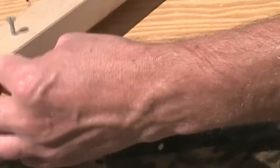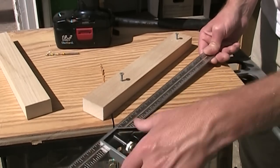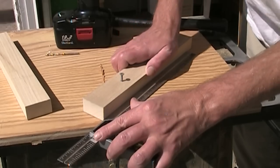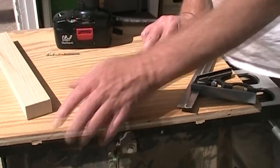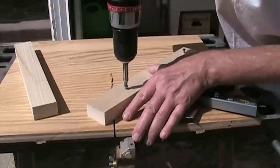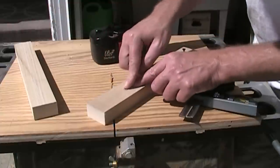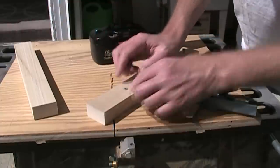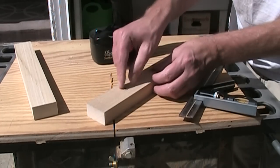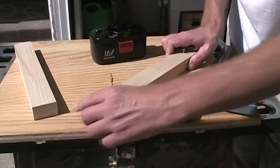What I can do is take this and line it up along that line. I can double-check this and make sure I'm still at that 45-degree angle — looks good. I'll press this board down so I can get some marks there and know where to drill a hole. Now I can screw it on in. The reason I did that marking maneuver is, one, I was afraid that this might move and the drill holes might not line up perfectly, and secondly, the top hole is a little bit bigger than the one in the plywood so that I can adjust this slightly if I need to.